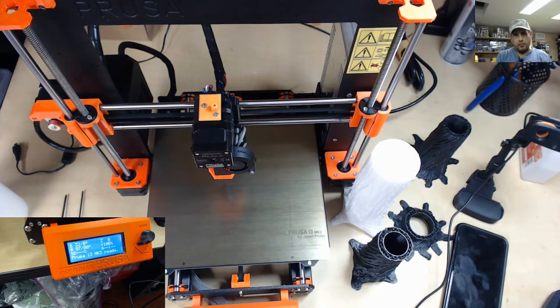I have to repair the Prusa Mk3 now. I've been using it to print some ABS and getting away with it. I've been turning up the heat bed a little bit to compensate for the temperature drops, but now it's getting too sporadic. The other day I was doing a small part and it dropped from 105 to 80 in no time, and I was playing with the wires and it wouldn't compensate.